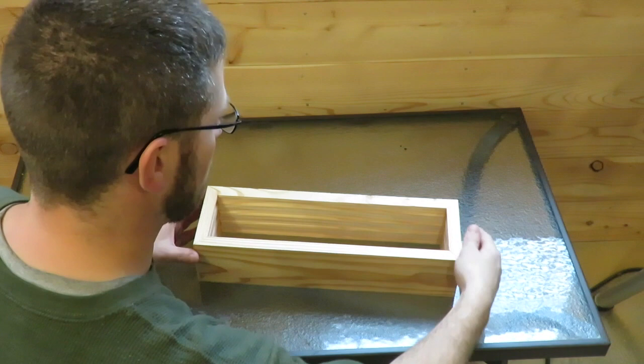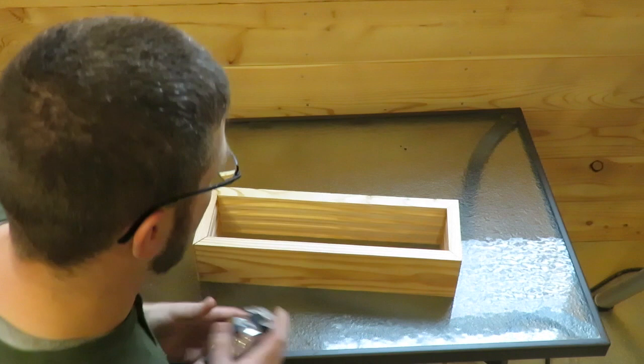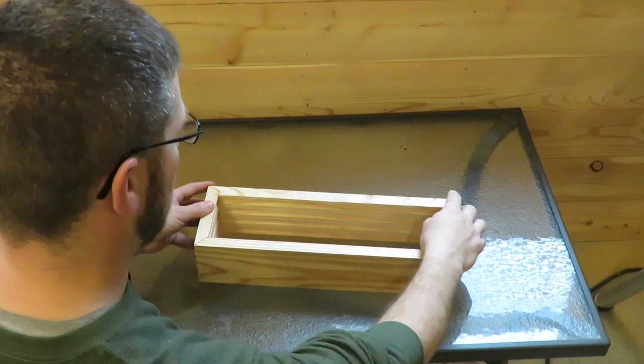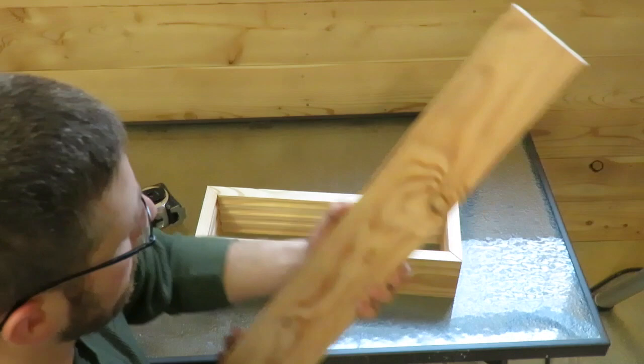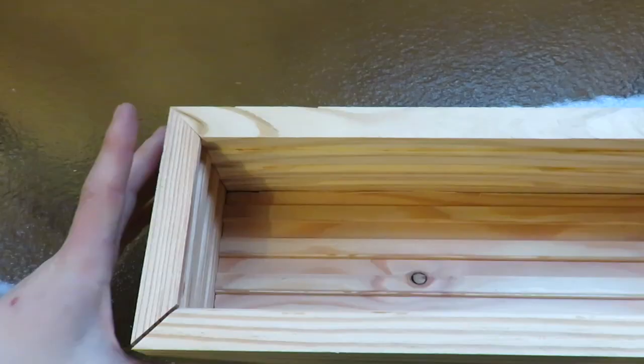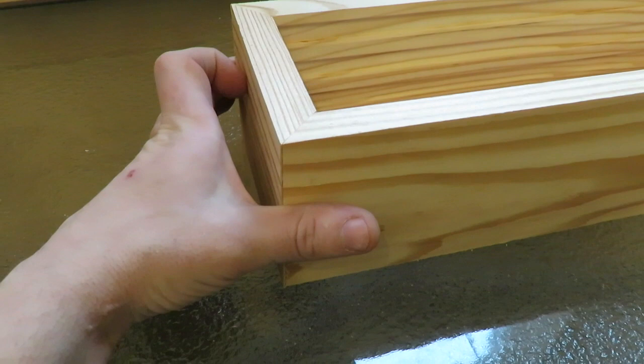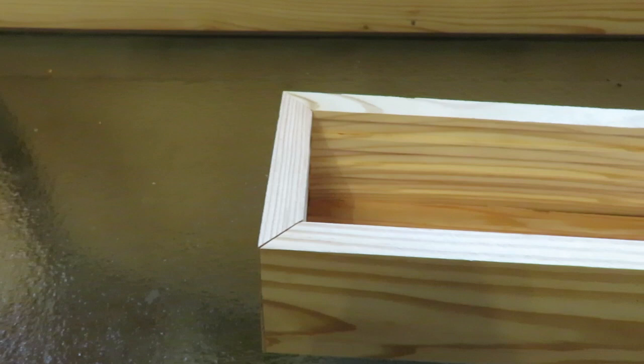One little trick at this point is to roughly assemble it before you cut your floor piece. Once you just have it sitting together, go ahead and measure the inside dimensions — we have 14 and a half by 3 and a half. If this inside measurement doesn't equal what you need, now is the time to adjust your end pieces. Once you have it cut, lay it down and dry fit everything before putting it all together. If your lines don't all line up, this is when you make your adjustments, either cutting a little bit off your 5 inch pieces or making a piece a little bit longer.